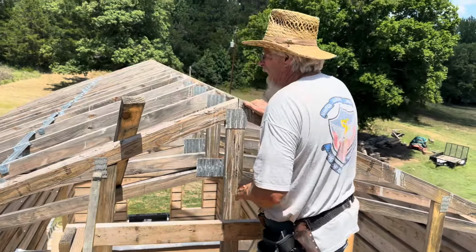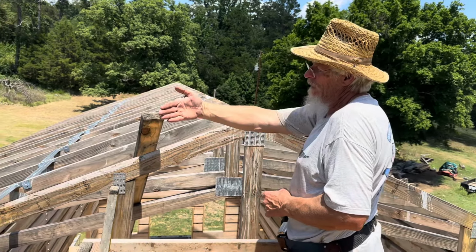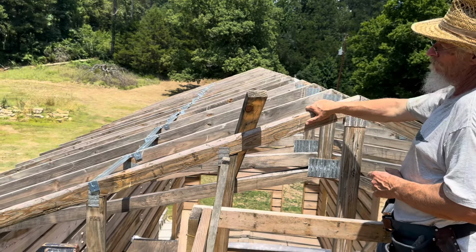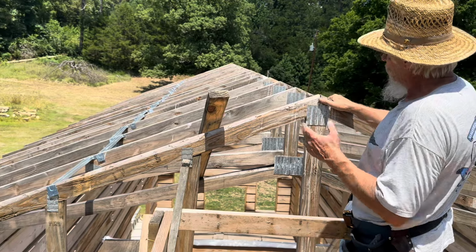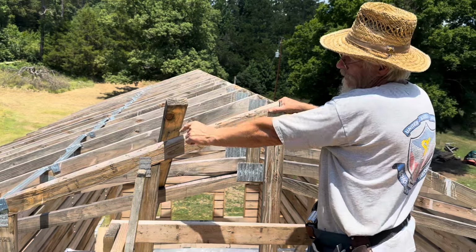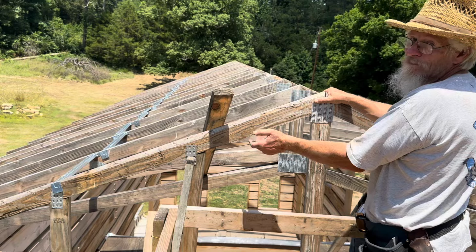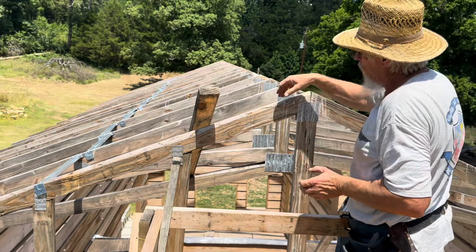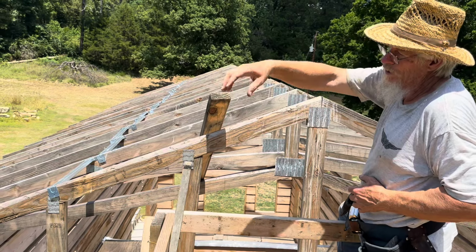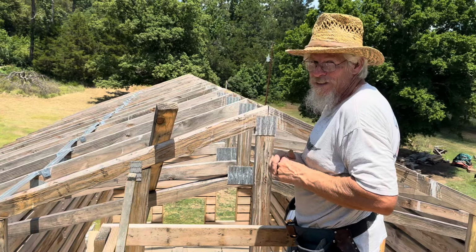At the moment, this outside truss, the top of it has a big crook in it. So we've got to brace all these up so they don't fall over. Then I have to take that metal spacer out and then straighten this truss up and brace it. And then every 2 feet we'll put in what's called a lookout that supports the overhang. You will see it in action.